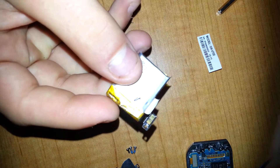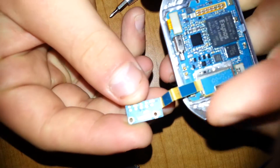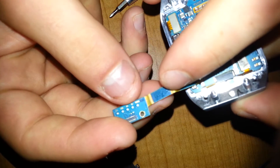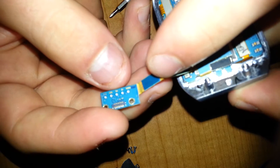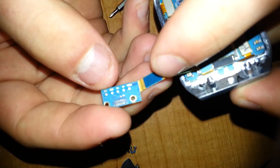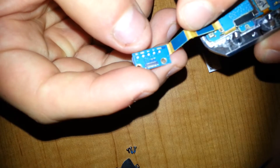I myself have tried to look up alternative ways to charge a Galaxy Gear because I didn't have a charger at the time, and all you had were pins. When I took it apart, I noticed that the other side had labels, and those labels are your connections for the micro USB: you have your V-Bus, your data negative, your data positive, your ground, and your ID. All you need to charge the watch is your V-Bus and your ground.